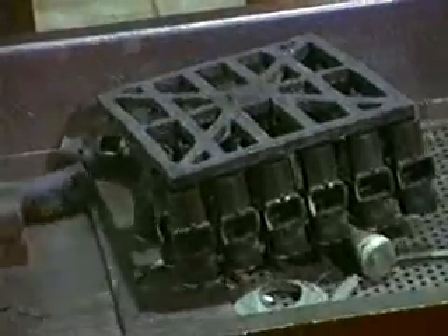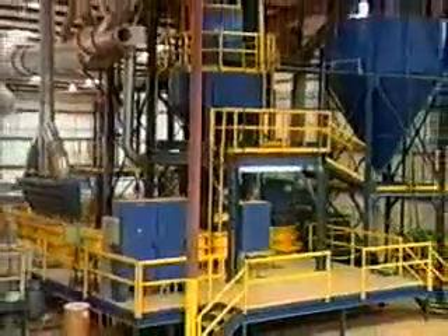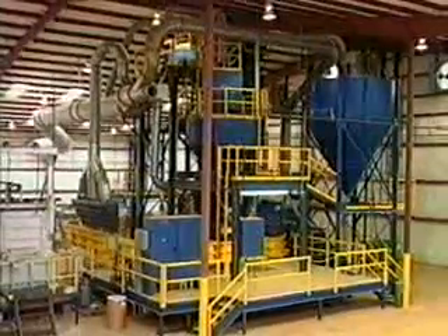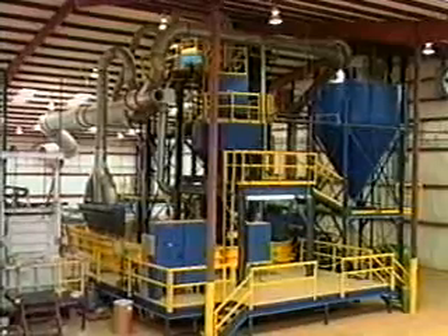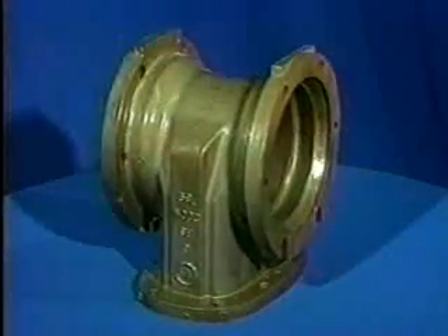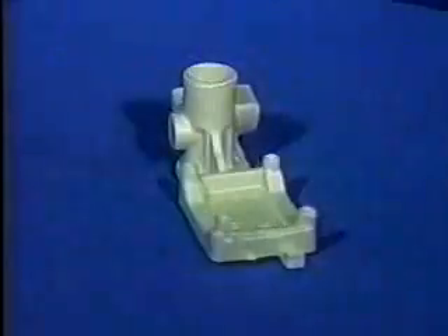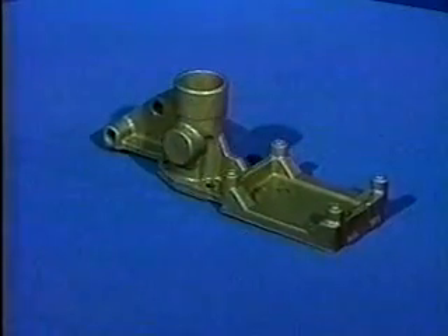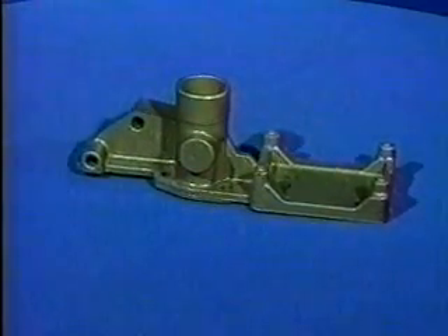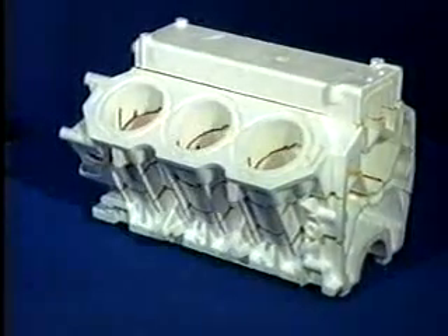More parts per mold means higher production at slower mold per hour rates. The dry, unbonded sand is easily recycled with minimum energy consumption. The mass of foam is low compared to the binders burned out in other sand processes, reducing emissions. This makes lost foam an energy and environmentally friendly process. Because there are no cores, core defects and fins are eliminated. Binder and moisture related defects are also eliminated. No parting line eliminates shift and parting line fins. These benefits reduce grinding and blasting.